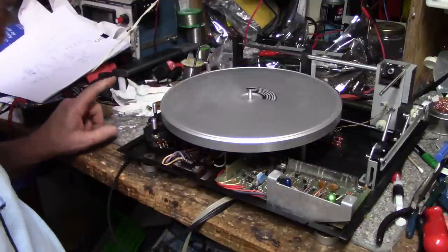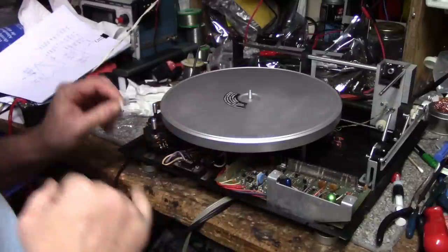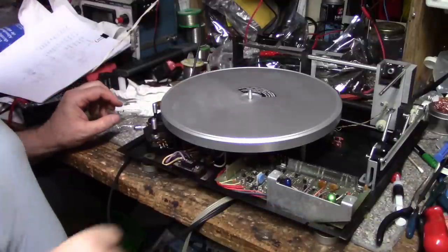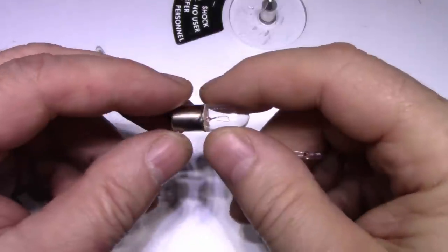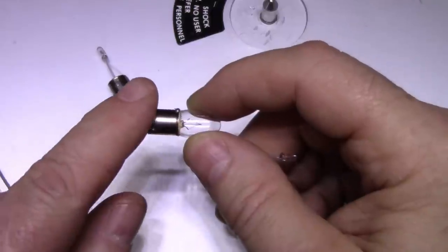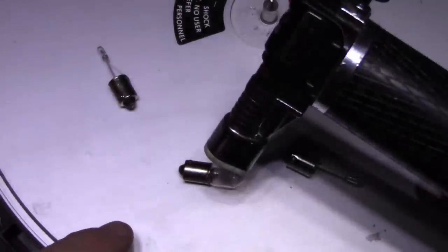Yeah, let me do that with the bulbs. What I'll do is I've got plenty of these 1866s. I'll gut a couple of them and then put the little grain of wheat bulb in them. And that will be my bodge for the day. All right, so you're looking at my solution here. This is what I modified. I took a regular lamp, an 1866. What I do is heat the base with a little propane torch or a little butane torch, something like this. Just heat it up.